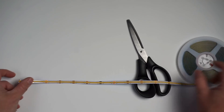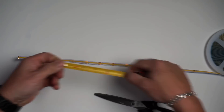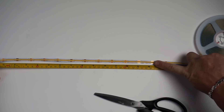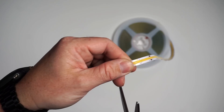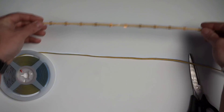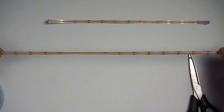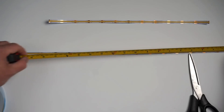You're going to need two pieces of LED strip for the K1 series machine. On the K1 Max, you want 14 and three-quarters inches for the front-right of the machine. You'll measure that and find the nearest cut point — it doesn't have to be perfect. You're also going to need one more piece that runs down the front and left side of the machine, and that piece needs to be 30 and a quarter inches for the K1 Max.